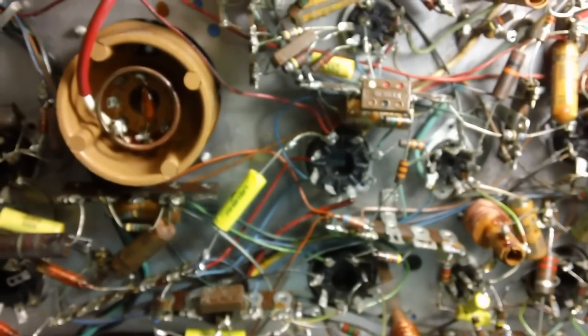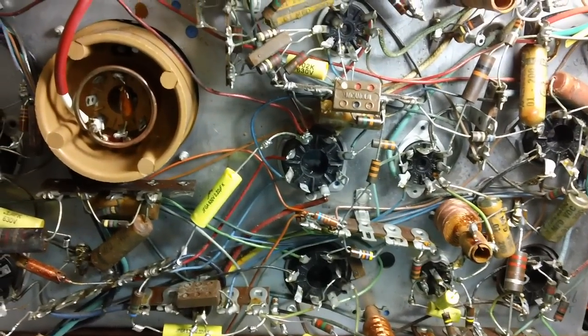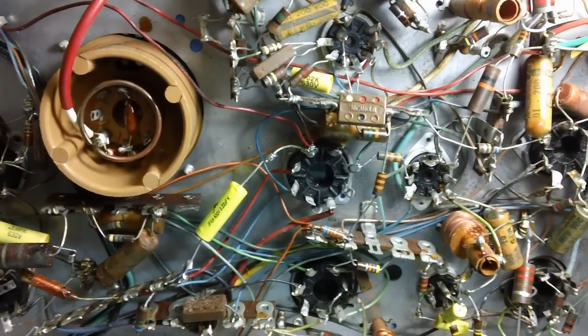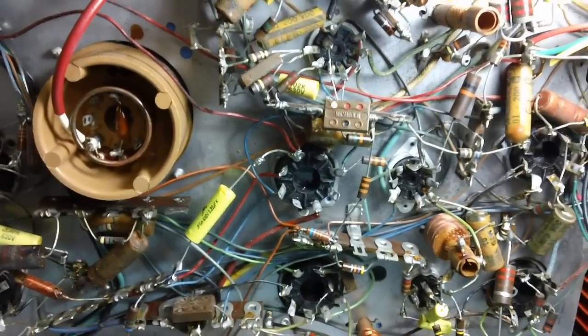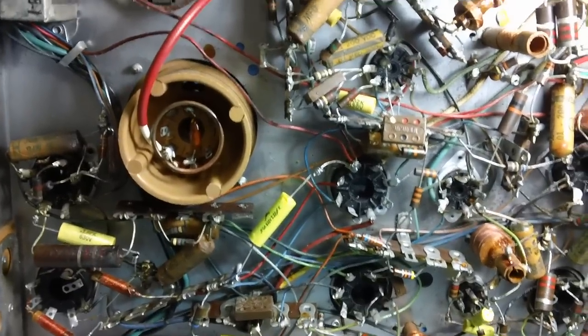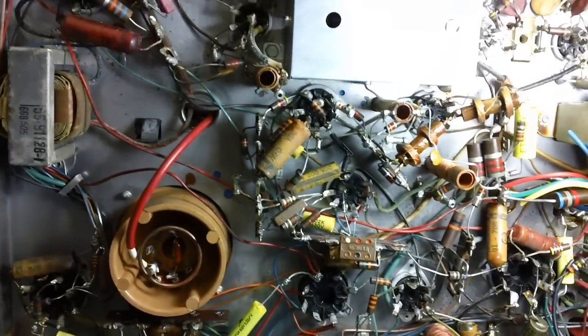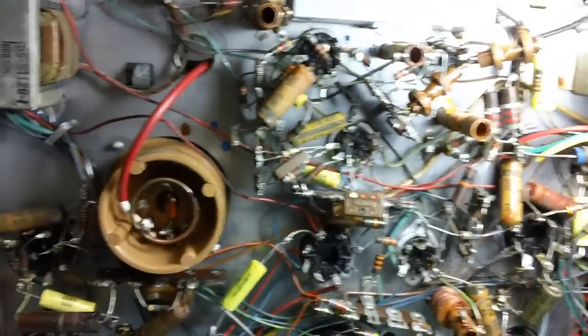The ones that are rivets or screws, nuts, bolts, and lock washers, star washers, things like that, they get corrosion between them after a period of time. And you lose the ground. That's just the way it is. But with a solder, it's a whole lot different. Unless the radio's been sitting in salt water somewhere. Even then, it still holds a pretty good ground.